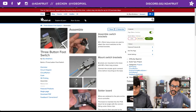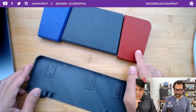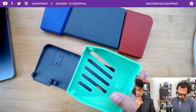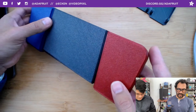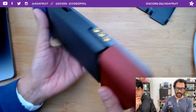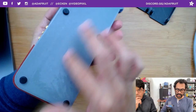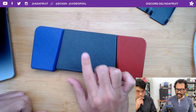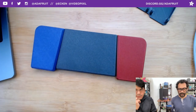That's pretty much it — a remarkably simple build. The longest thing is going to be the printing, about a day of printing total. Each button on the single-switch version takes about two and a half hours. You can see the texture from the PEI texture powder-coated plate — definitely recommend using that, otherwise it'll look slippery. If you don't have the powder-coated bed, you can add vinyl decals for texture, though it sticks better to glass and PEI surfaces.